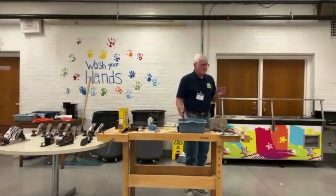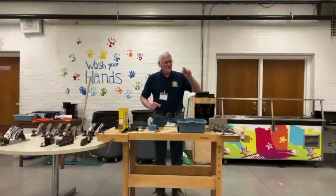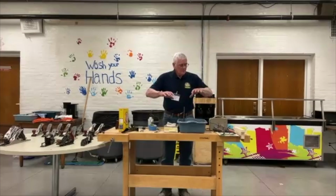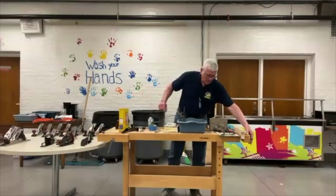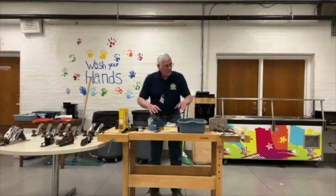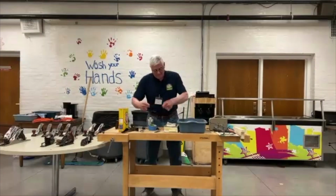Well, it's time consuming. Like I said, I have a piece of glass, about maybe 3 feet long. I'm not sure now what it was, but it's very thick, maybe a 1/2 inch to 3/4. I got it in Coventry glass. Then I put sandpaper over top of it. I start with like an 80 grit. I clamp it down, two clamps on this end and two clamps on the other, on the sandpaper, so it won't move. I have it designed so it fits perfectly on my bench at home. Then I start. I used to count the strokes, and I'd get up to around 3,000.